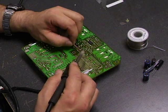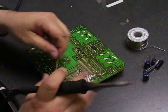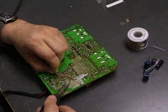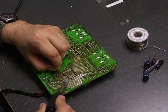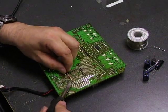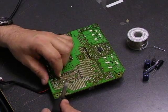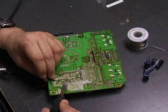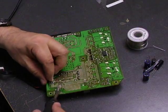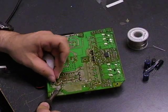While we're doing this, a heads up: you do need to make sure you use good quality capacitors. They need to be rated for low ESR, which is equivalent series resistance. They need to be rated for high temperature and high ripple current. This is not the kind of capacitor you can get at a local electronics store like RadioShack — those are just general purpose capacitors, not rated for the high temperatures and stress levels inside power supply circuits. They will fail shortly, and when they do, they can damage more of the circuitry than just the capacitors. So you don't want to compound your problem by getting low-quality parts.